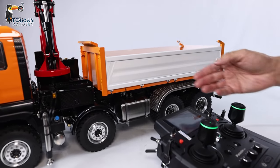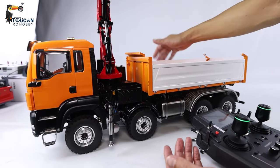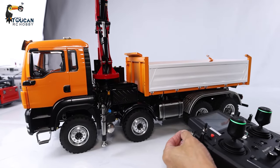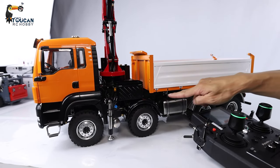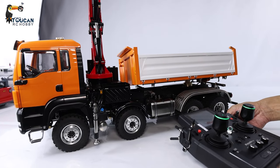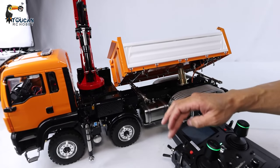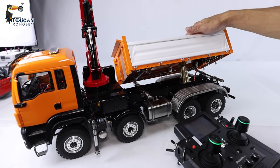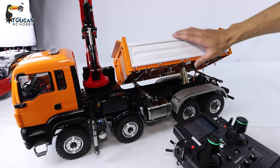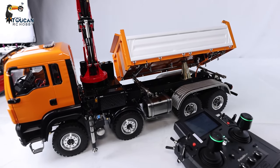Okay, in position. Now we open this side for shifting — other side locked, this side open, dumping to right side. Both are open, right side locked — now dumping to right side. Again, after rising the bucket, never shift this lock. Otherwise, as we showed, it will drop the bucket and you'll have trouble putting back all the locks. Thank you for watching, see you.